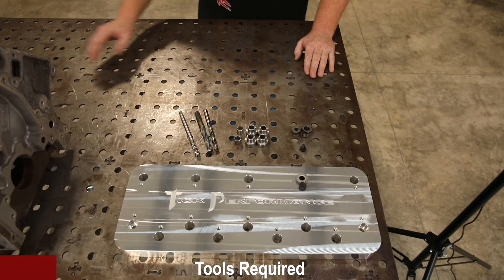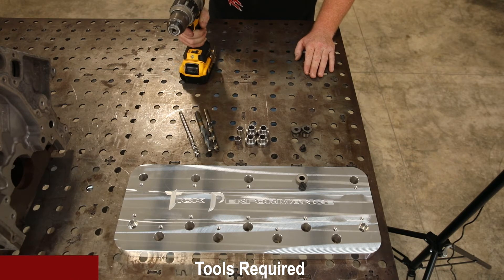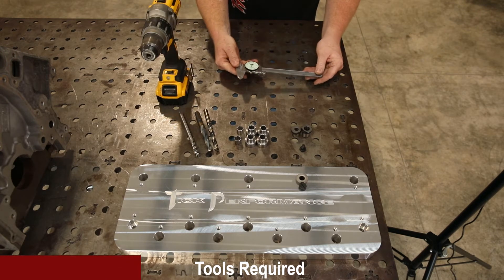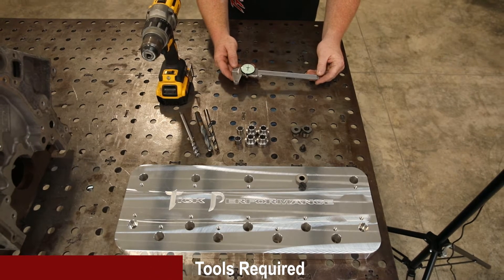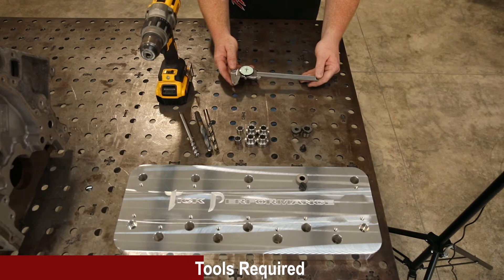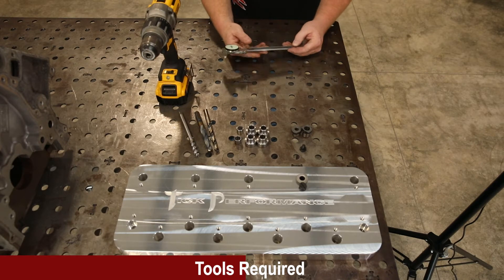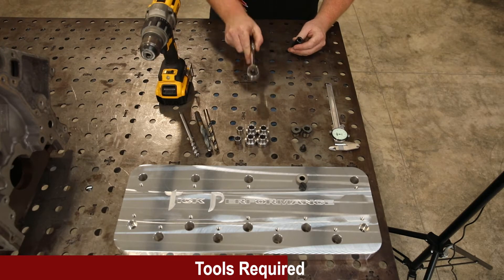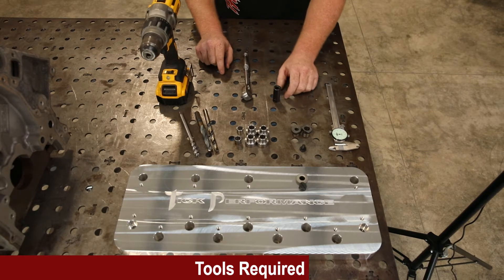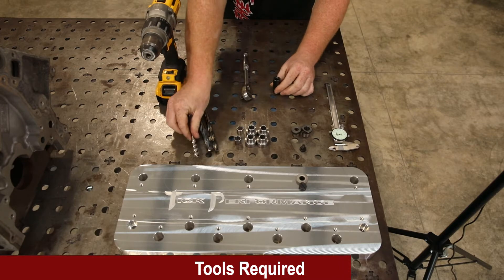There are a few additional things you'll need. First, a good hand drill — air powered, battery powered, basically any drill with a half-inch chuck. You'll also need some form of way to measure hole depth. We're not going to pre-mark these drills; we leave it up to the end user to measure their depth, mark the drill, and get their hole depth correct. A good set of calipers works fine — doesn't have to be ridiculously expensive. And then you'll need some form of tap drive; today I've got a 3/8 ratchet and a tap drive that slips onto the hex or square of the tap itself.